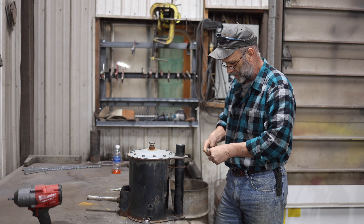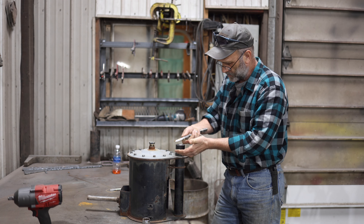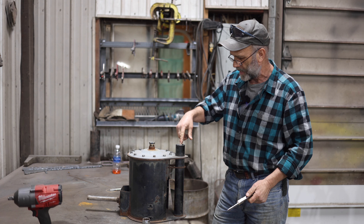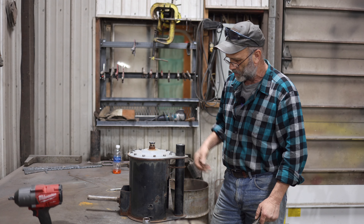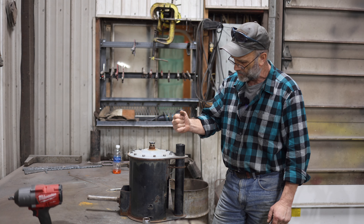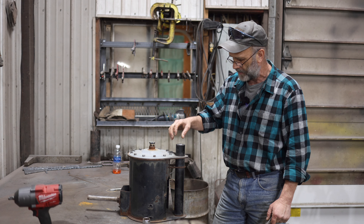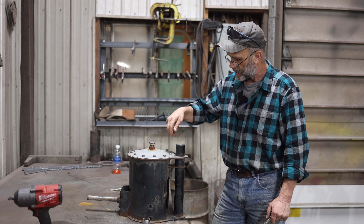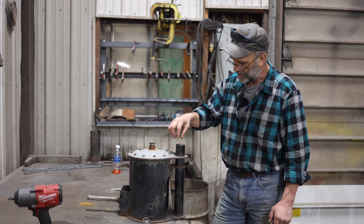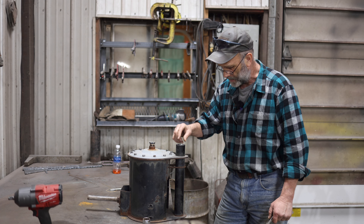When this compressor's working, this diaphragm will push air up through this assembly, through an air line, through an elbow over in here. Now, when they built these things originally, they used plastic elbows. The problem with plastic elbows versus the old brass ones is that over time, the sun will cook those things and they don't work anymore. They break.